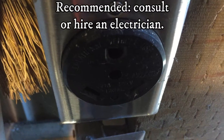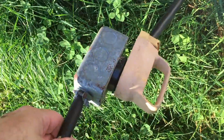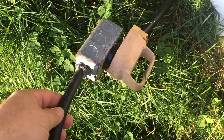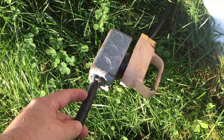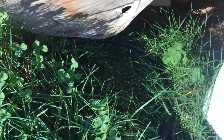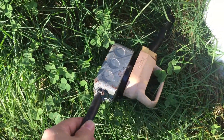With these large blades, you have to have a plug that's wired for 110, and the circuit breaker going to it is at least a 30-amp circuit breaker, and it only goes to this one outlet. Here's the other end — this cord has, of course, the right connector for it, and this cord is less than 50 feet — actually probably about only 40 feet, if that. So 8-gauge wire coming this far as an extension cord is not a big deal. Of course, I keep this in a dry area, which is underneath the trailer, sitting on top of that piece of aluminum there. This keeps everything pretty well outdoor safe, even though I don't recommend a metal box — that's what I had at the time.